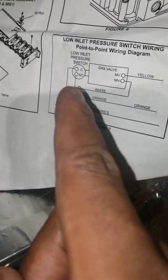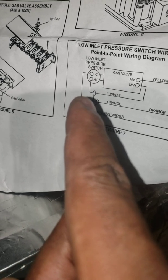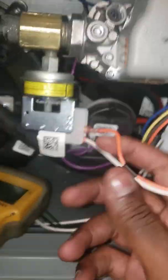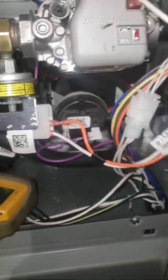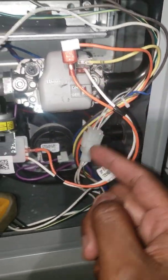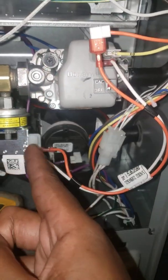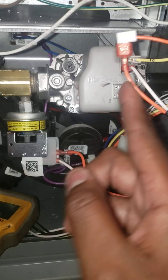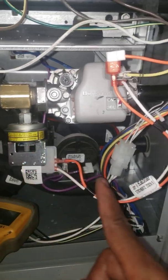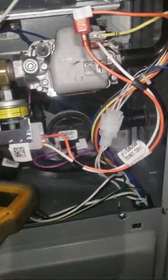What they want you to do is connect the two wires to your low gas pressure switch, but out of those two wires, one connects to the incoming wire going to your gas valve. To make a long story short: 24 volts goes to your gas valve, through the switch — the switch will open when there's an alert of low gas pressure — then through the low gas pressure switch and back to common on the circuit board. Pretty simple.